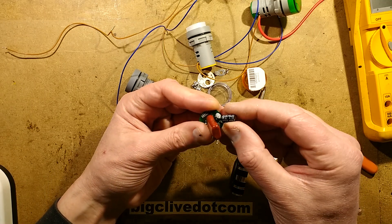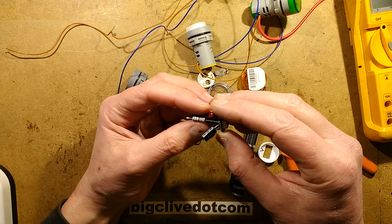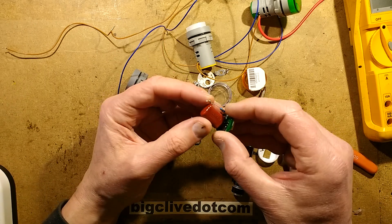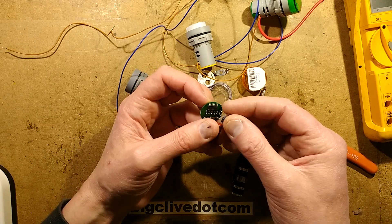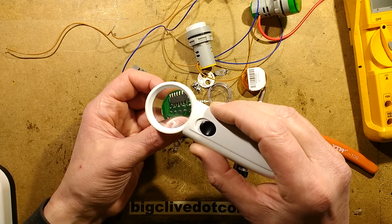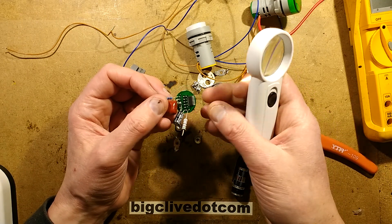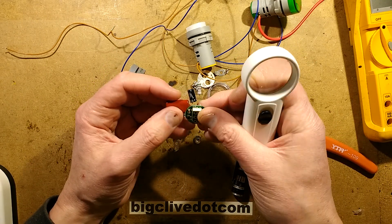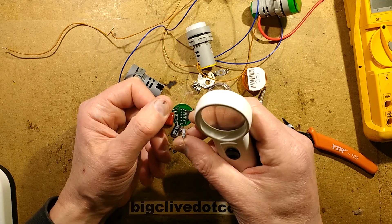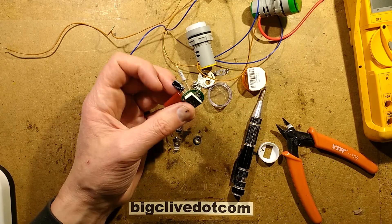This capacitor is 330µF at 16 volts. This resistor is Green, Brown, Black — that's 5, 1, no zeros — so 51 ohms. There is a chip under here which is just going to be a microcontroller used as a general display driver. It's anonymous, which is annoying. After that it's just a smattering of other components — a couple of diodes, a capacitor and resistor. Probably one resistor provides a voltage divider reference to the chip's input, and one resistor limits the current for the whole display.